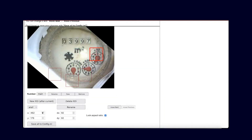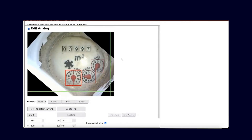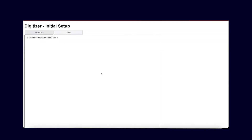Now we can set the analog meters, doing them one after the other: start at 0.1, then go to 0.01, and then to 0.001. The last analog meter is not necessary in my case because the meter simply doesn't have one, so I clicked on Delete ROI and then Save Config. In the next step, I can adjust the configuration again, insert MQTT, and check everything. That's why I pressed Use and Save Config again, and in the last step selected Leave Setup Mode and Reboot to Normal to save everything and restart the ESP.